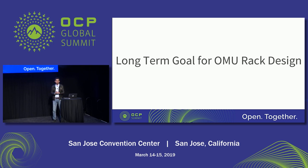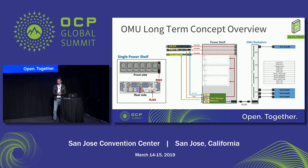Those are our current designs, and we are planning to conduct a POC with Microsoft. After getting results and community feedback, we'll determine how to move forward. Our current concept for the long-term goal is to have a single power shelf supporting up to 27,000 watts per rack — either 12-volt or 48-volt in the future. With a single power shelf, we're thinking the rack manager should be located inside the power shelf directly, so you don't need to go into the hot aisle to service it. The RMC would be located inside the power shelf.